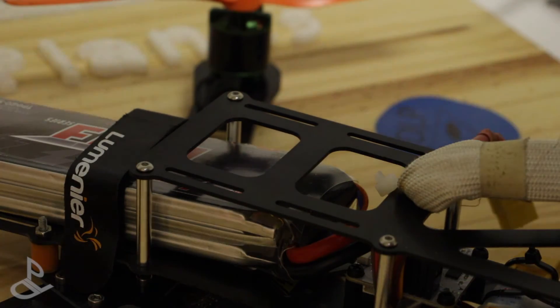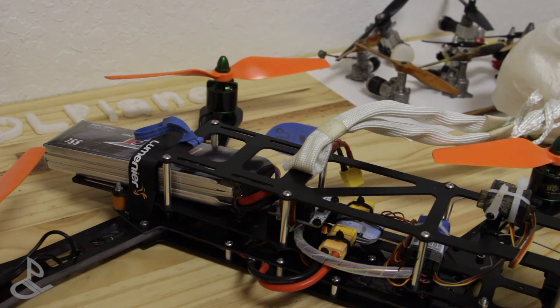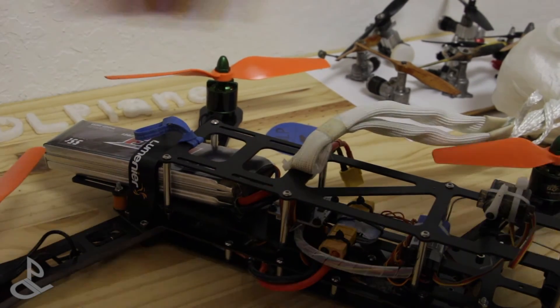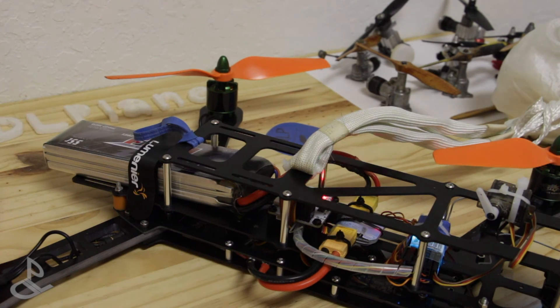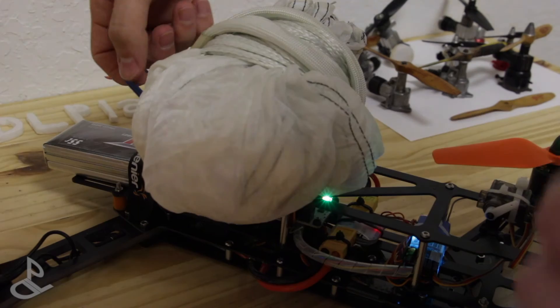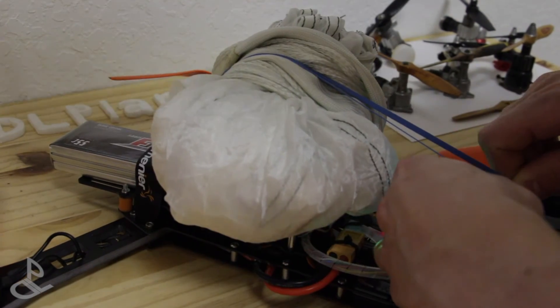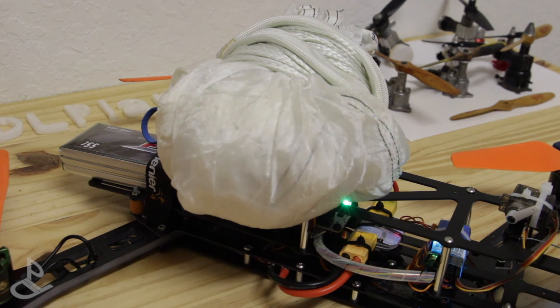The last thing I want to do is attach a rubber band here. I found this blue rubber band that should work. Now all there is left to do is to test it out, so I'm going to turn it back on. I have to reverse the servo because it is in the wrong direction. Let's bring the rubber band over the parachute — that is pulling on the servo. You can hear the servo; it's pushing against the rubber band. Let's test it out — I'm going to hit the snap switch on my transmitter and that should just release the rubber band. Perfect. Let's test it out a few more times to make sure it works.